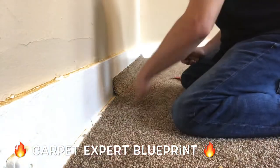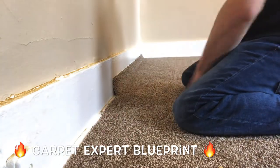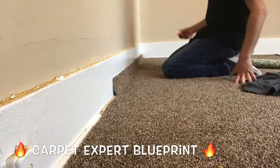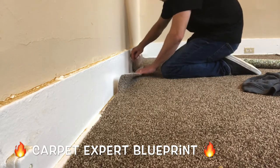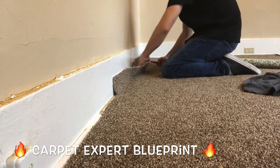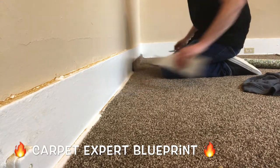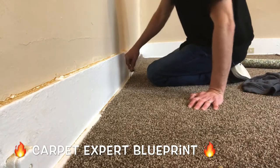Here's another little trick — if you cut it, let's say a half inch hefty, and you're just trying to tuck it in but it looks like a hot mess, tuck it as best as possible, then take your knife and just shave that little excess off. The pros: it's a great way to save from cutting off your fingertips. The cons: it could mark up your baseboards. If you have really beautiful baseboards, you may not want to do it. If it's old baseboards that have 40 layers of paint on them already, go for it — it'll hide in there.